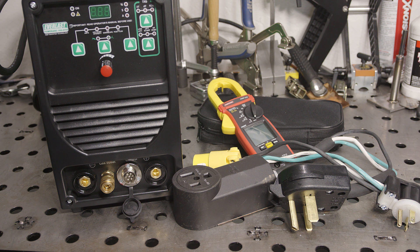The magnetic trip system is essentially an instant trip system. There's a small electromagnet inside the breaker — the more current flowing through it, the higher the magnetic force, and if it gets high enough, it will trip the breaker. However, that magnetic trip point is typically quite a bit higher than the rated trip point. So if a breaker is rated at 20 amps, the instant magnetic trip point is much higher than that. The reason for that is to handle short overloads, such as a motor starting. If you go to start a saw or anything with a motor where you have that instant surge draw that immediately drops again, you don't want that tripping a breaker every time. For a 20-amp breaker, the instant trip point could be as high as 50 or 60 amps or maybe even more, depending on the exact rating of that breaker.